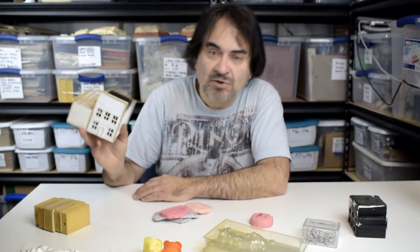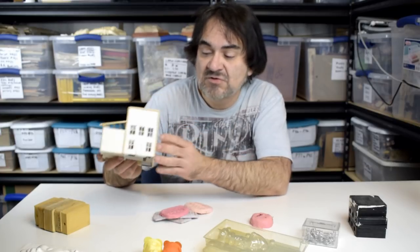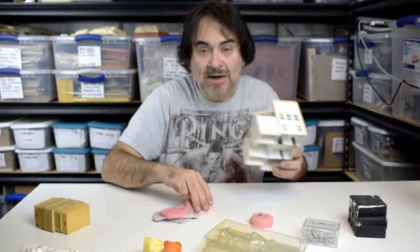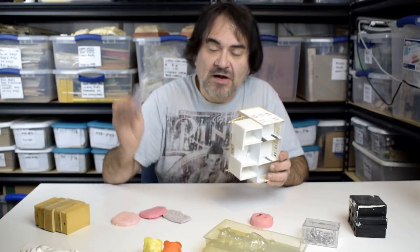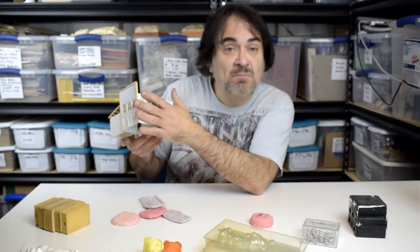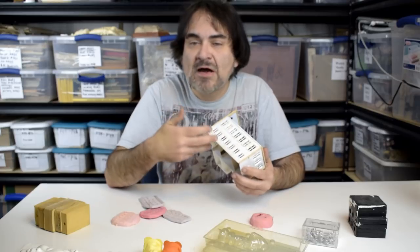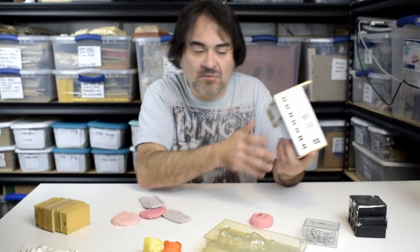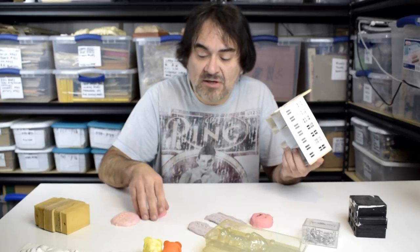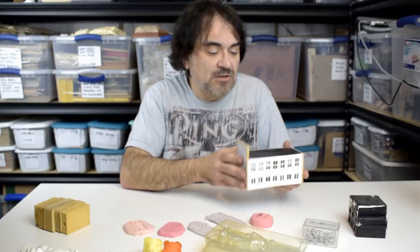I've showed this in another video — this is a building I've been working on. Some of these can sell for $300 to $400 for one building. This is going to be a hotel. I actually cast windows and things like that that I can make my own copies of, make tons of windows, then make a mold of just the side of a building. I can make my own buildings with kits that only take minutes to pour a mold, pull it out, glue it together, sell it unassembled and let somebody else do it. You don't have to be a big wig to make plastic model kits. I'll show details on my trilobite in a separate video soon — be on the lookout for that.